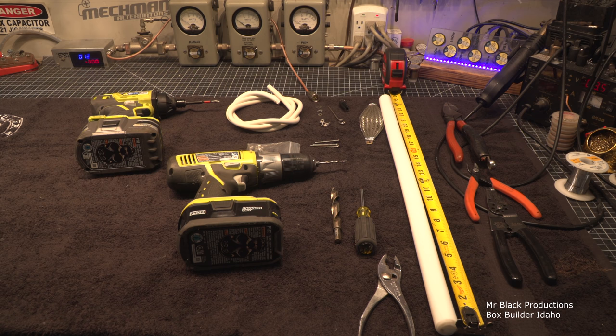There's a little bit of math that goes into this, and a little bit of knowledge that goes into this. Usually when you see these, they're about 2 to about 4 foot long. Well, 2 foot in my mind is good for anything around 5,000 volts or below, which is where I do most of my work. When we go to higher voltages, we have meters that will tell us if we're depleted or not. This is something that you keep around just in case your bleeder circuit decides to fail and you need to be able to go into the space of the high voltage and do work.